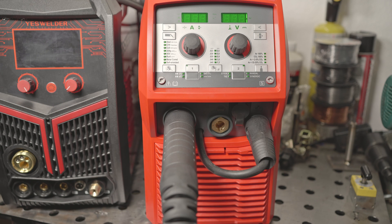Finally, I have a Fronius Transsteel 2200. While the Hitbox was less than half the price of the Yes Welder, the Fronius is over twice the price. It has far more features, far nicer accessories, includes a gas flow meter, and feels like much better build quality. It can do auto-synergic MIG with material thickness selection as well as full manual MIG. It has interval welding, spot welding, 2T and 4T modes with multiple 4T options, inductance control, burn back control, and an adjustable arc length setting for when you're in automatic synergic mode.